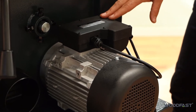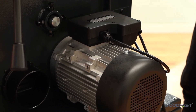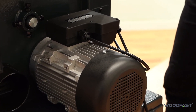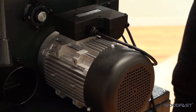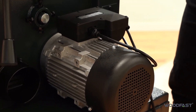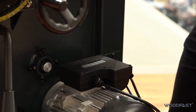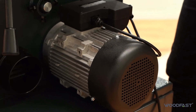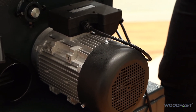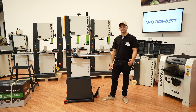This machine comes with a two horsepower induction motor. The motor also has a brake in it, so when you turn it on or off you'll hear a slight squeak — don't be alarmed. That squeak at startup is the centrifugal force releasing the brake, and when you turn it off you hear a click as the brake applies, slowing down the blade faster so it doesn't free-spin as long. Thanks for watching — we'll see you next time. Cheers.